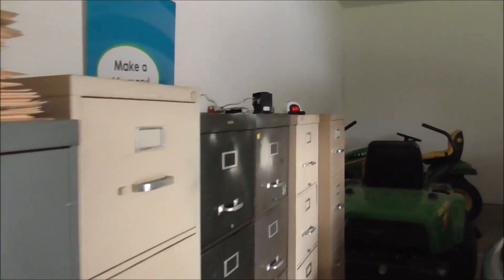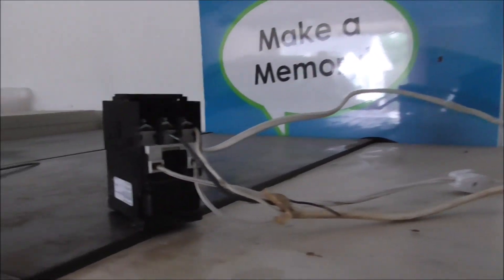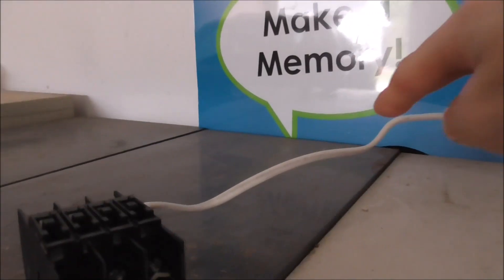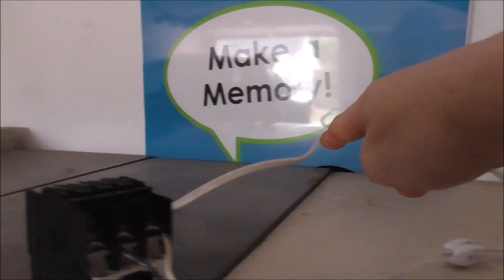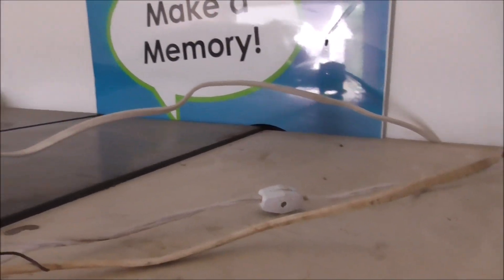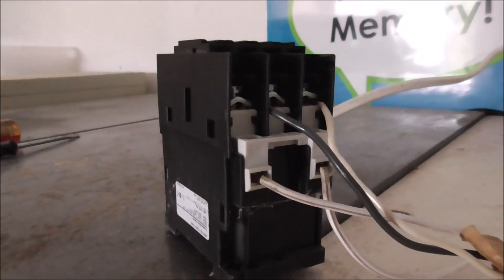Which is in the garage. Here's the motor starter. This is connected to the outlet — this is the main power source that the siren is on, which is controlled by a motor starter. This is connected to the wall outlet, and this is connected to the actual siren. This is the motor starter's power source — this does not control the siren, but just the starter, which clicks up and closes the circuit.